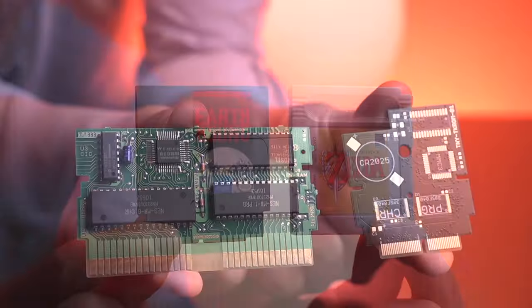Next up is the audio board. Red Herring supplied this spiraled wire for the audio and ground. The spiraled wire helps insulate the sound and reduce noise in the signal. We'll also be using the same type of wire for the audio connection. And since it is hard to distinguish which wire is which, since they're both a copper color, I recommend using a multimeter to ensure that you're making the correct connections. And here you can see we use the same wire to connect the LCD driver board to the motherboard.